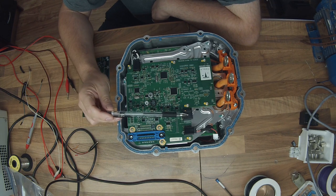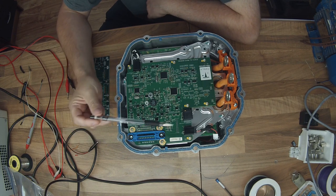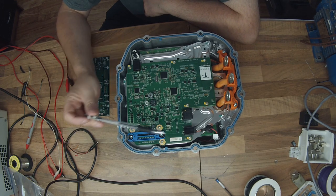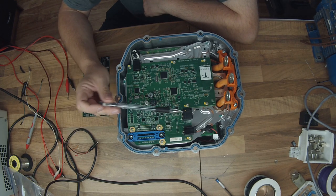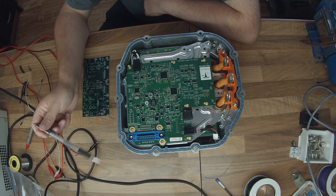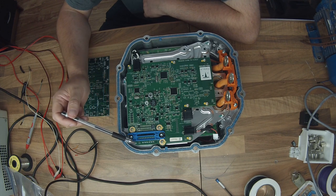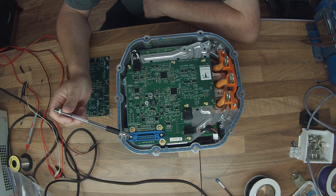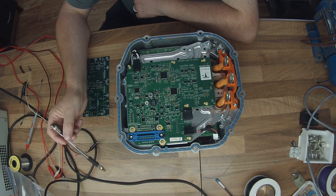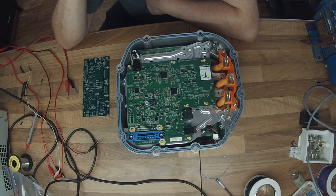The first thing to jump out is these connectors - they are JST but a different type of JST, so we are going to have to find out what they are. There are also through-hole pins rather than the surface mount type that we used on the large drive unit. There is a connector here - where you see this blue plastic - a 20 pin connector to the outside world where signals and power signals come in. I am going to get a pin out of that from my service manual and we will start to power this thing up. It does not look like an AmpSeal and it has got 20 pins, which is a non-standard connector for the AmpSeal range.